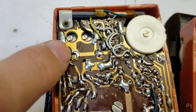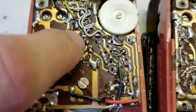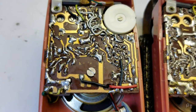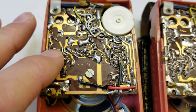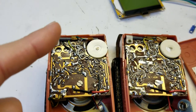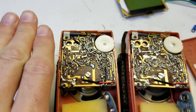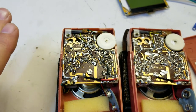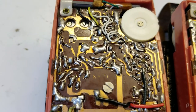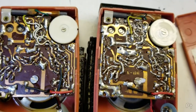Just globbed all over. This is horrendous. All of these solder joints are round. I actually took a class on soldering, believe it or not, and they taught high reliability soldering where you don't want a big ball balling out like that. You want a concave surface between the leg of the part going through the board and the surface of the board. Apparently that gives you the best connection. This is not it — this is just glob it on and do whatever. And this one's even worse.